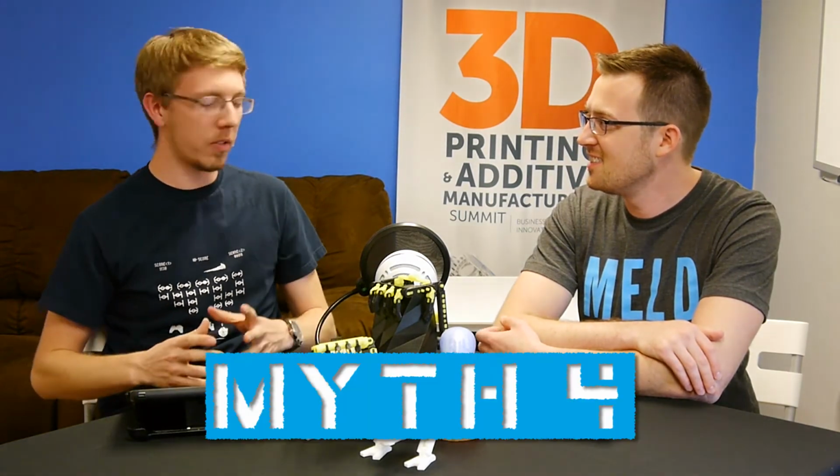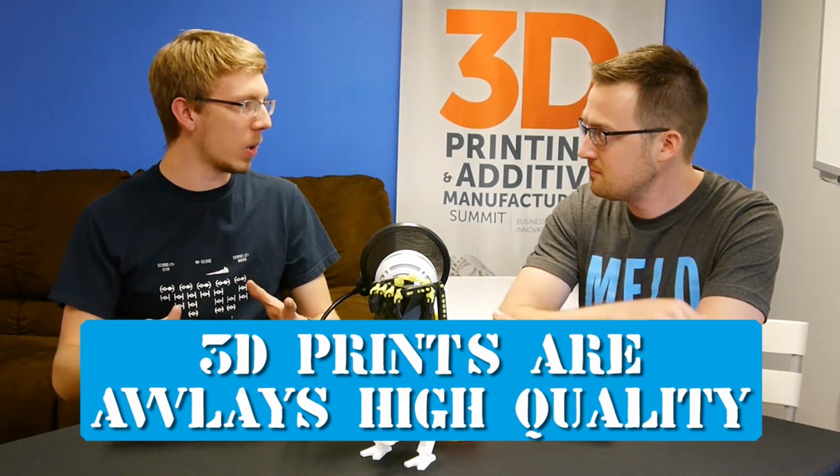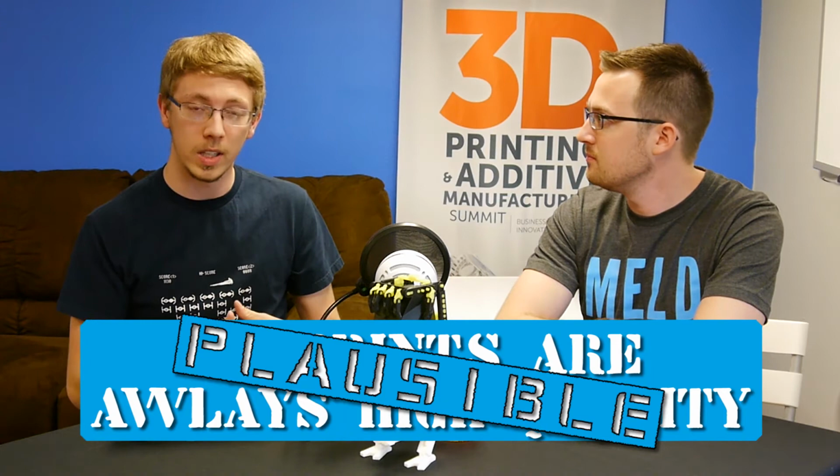But so, myth 4, 3D objects are high quality, is, again, plausible. It all depends on what your viewpoint of high quality is. If 200 micron standard resolution from a MakerBot is high quality to you, then that's high quality. If you're in medical grade and you want 16 micron layer resolution from an SLA MJP machine, that's high quality to you, and FDM is not at all. It's far from it. Yeah. But then you're going to need a $200,000 machine versus a $2,000 machine. There's that trade-off of price and quality. You do get what you pay for.